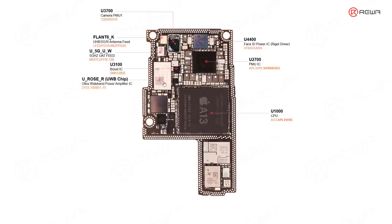This one is the UWB chip — UWB is short for ultra-wideband. And this one is the audio codec IC, which is mainly responsible for control of the audio-related circuits, like the microphone circuit, speaker circuit, or vibrator circuit.